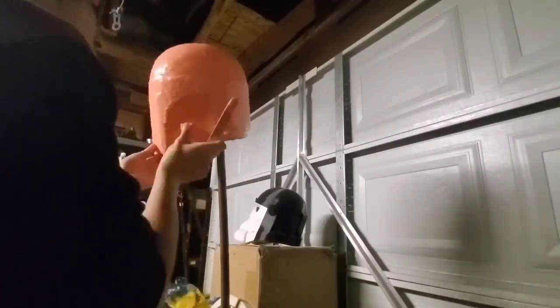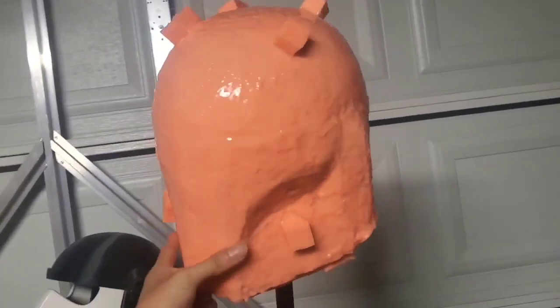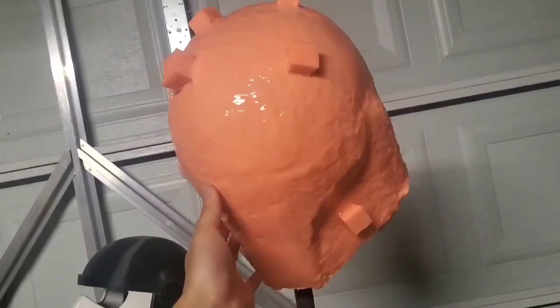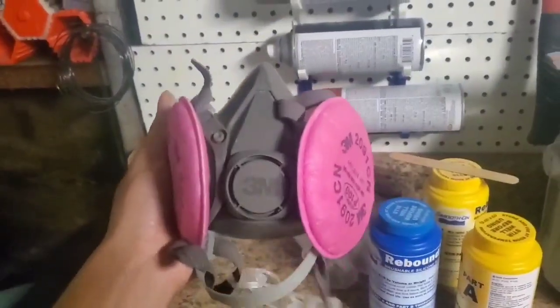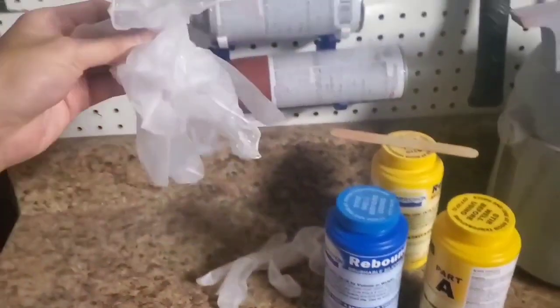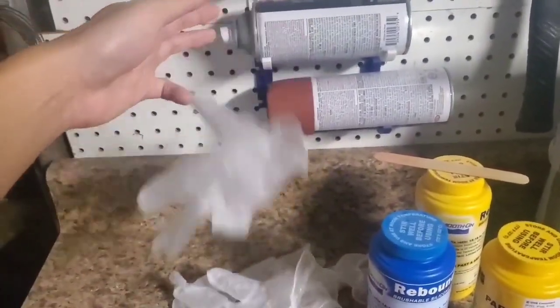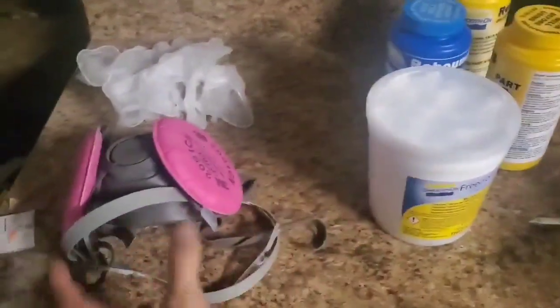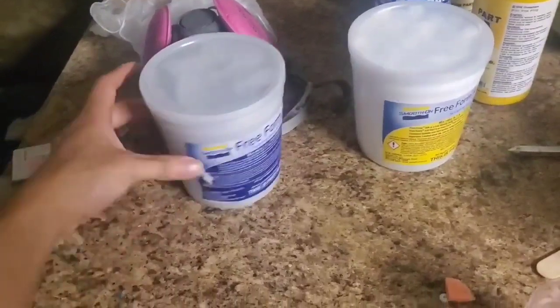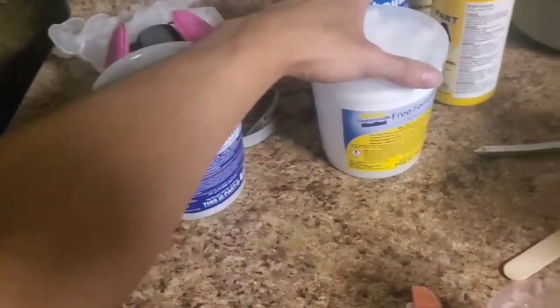Right here is where I'm going to attach them everywhere as best as I can, but adding them on was kind of annoying — after I was done, though, I was glad. For this next part, you will need a respirator and some gloves that you're just going to want to throw away, because right now we will be using epoxy dough. This is a two-part material that comes in clay form. For this stuff to work, you have to mix it together properly, and it's easy to use.